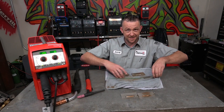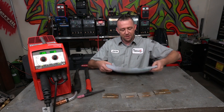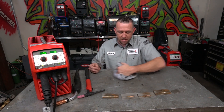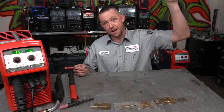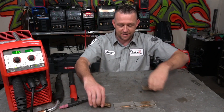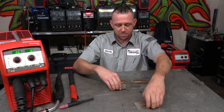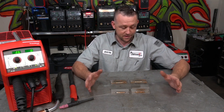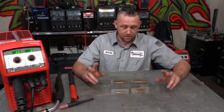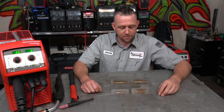So at the end of the day, there's something to be learned here, very simply put: if you are using anything to prep your metal, make sure you use a dedicated brush or wheel. Otherwise it's going to be subject to rusting — all that impregnation, it's pretty significant. And just to recap: if you want to weld stainless steel with any mild steel or carbon steel filler rod, there's nothing really stopping you except that somewhere down the road, it's not going to be stainless anymore.